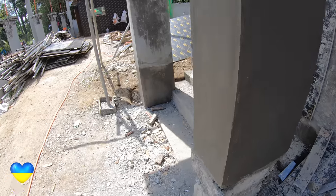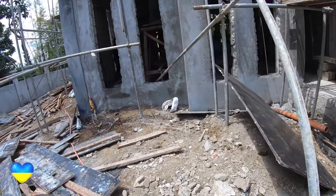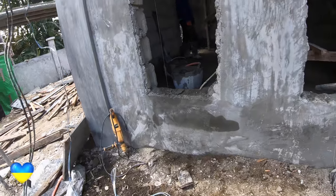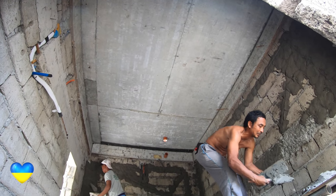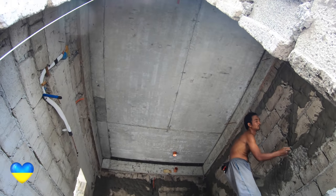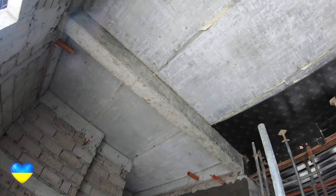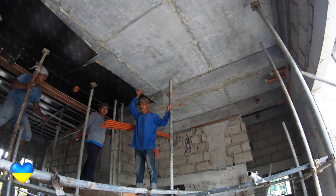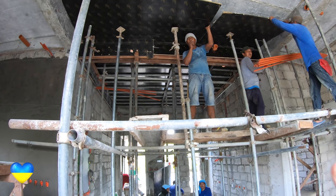This is a testament when you look at the ceilings as to whether the quality of the pour was good or bad - whether you see honeycombing, whether you see humps if they didn't have the proper support underneath the wood. Let's look in this bedroom right here. That looks really good - nice and level, nice and clean. I don't see any evidence of honeycombing. Very, very nice pour up there. Now it's a beehive of activity in here. This is the kitchen and dining room area. You can see they're slowly removing the formwork right now, and we'll come back later once all the scaffolding is out of the way.